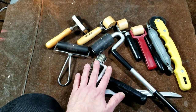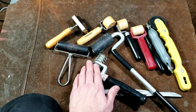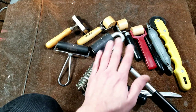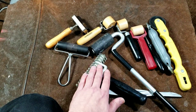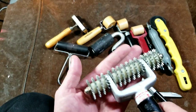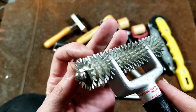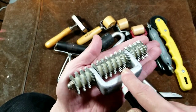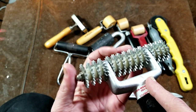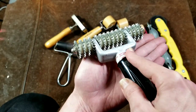Now, when you're doing that carpeting, it can be tough. You're stuck walking on it, doing all sorts of strange activities in motion, trying to tamp down the entire seam of the carpet so it looks like just one piece. And so that's what these rollers are for. They allow you to roll it on. The little spikes get through the pile of the carpet, so they'll press down deeper and really get you good adhesion. And the spikes have the double duty of also pulling on the fibers along the edge, so it kind of blends that edge.